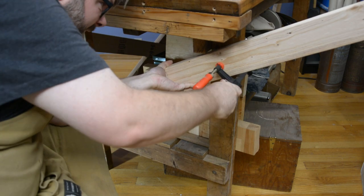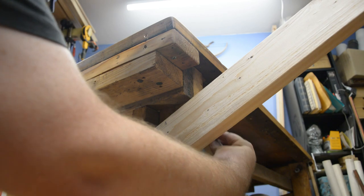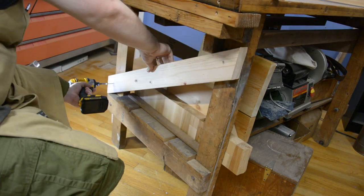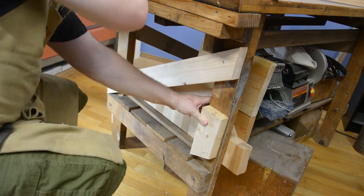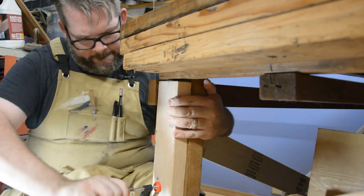Take your 2x4 and clamp it in place to the workbench. Then on both the top and bottom, take your Sharpie marker and mark where the leg of the workbench meets your 2x4. These marks will show you where to cut so that it fits the way you want it. Then grab two screws and tack it back in place for now. Grab two cutoffs of 2x4s — whatever you have laying around — and put them in the opposite spaces, top and bottom, to work as bracket spacers for now.